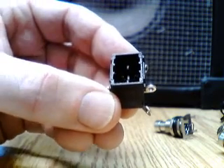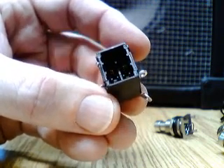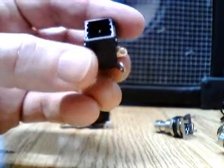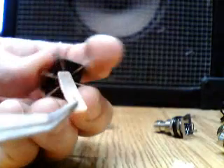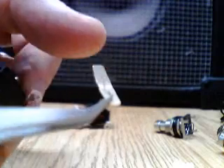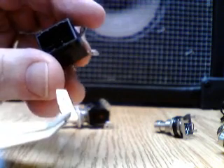One of the things that frequently happens with hobbyists is that they may be applying way too much heat when they go to solder wires to these. There's usually a little dab of grease on both the plastic part and on the rocker contact. When you apply way too much heat to the solder lugs, that heat is transferred into the rocker contact, and sometimes if there's too much grease on it, the grease will liquefy and spread across the contact, insulating it rather than allowing it to make contact with the inner part of the solder lugs.